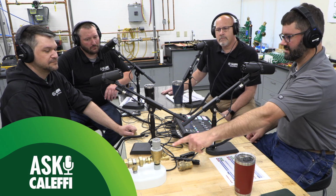I guess another thing to bring up about our PRV is the knob on the bottom. A lot of questions about that. Basically, that's just a service valve, an isolation shut off. What I tell guys to do is, if you want to run an automatic fill mode all the way down until it stops, you backseat the valve. If you want to shut it off, everybody goes, well, we got a ball valve. Yeah, you could use a ball valve, or you could use this too. If nothing else, in service mode, when you're trying to get this cartridge out, you can use it to help push the cartridge up if it feels a little stuck. You front seat it all the way to the closed position, and it'll push that cartridge up.